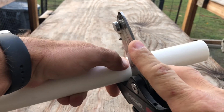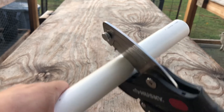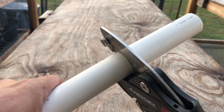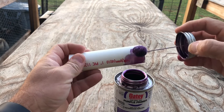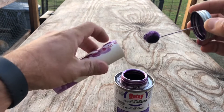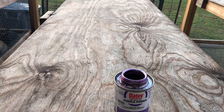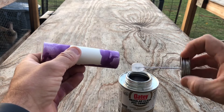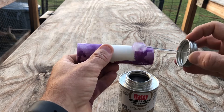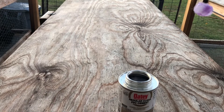At this point you want to build the piping that gets out of your barrel over to your tubing. You don't need a tape measure, just do approximate lengths and get it cut nice and clean. I like to glue everything — start with primer on one side, then glue for a nice clean surface and a strong bond. This isn't strictly necessary but with water I don't want any leaks. The purple primer is very visual so you can see what's been primed, and then use a clear glue making sure you get all the way around so there's no unglued section.